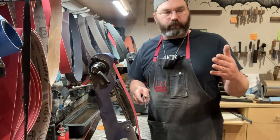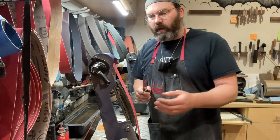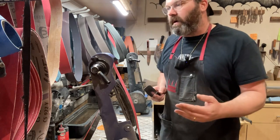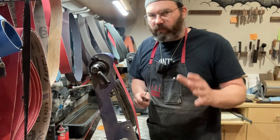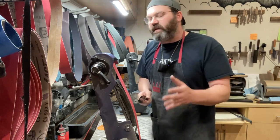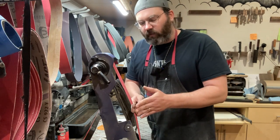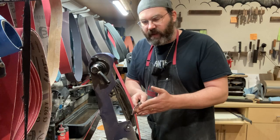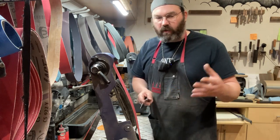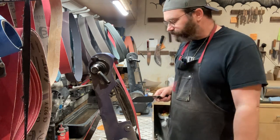So you're going to grind it, the knives are super dull, you're cutting a new edge into it. You want to be in the ballpark, I'm not saying it doesn't matter, but dispelling the myth, you don't want to worry about whether it's 15 or 16 or 17.875, it doesn't really matter. As long as you're in the ballpark: with a good knife, you have a low angle; a medium knife, a medium angle; a lesser quality steel, you want to put a wider angle on it so the edge will hold and at least give the customer some sort of satisfaction.